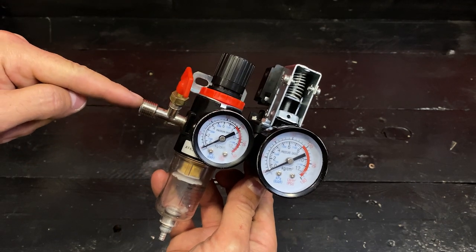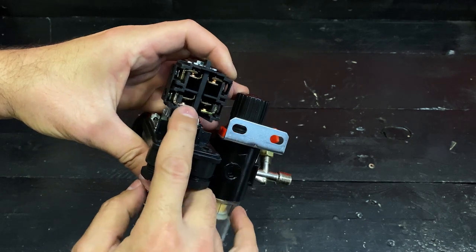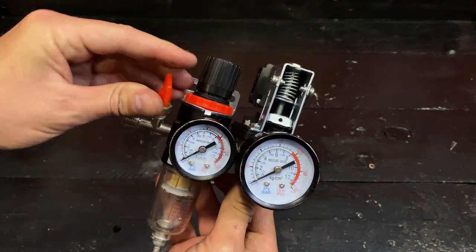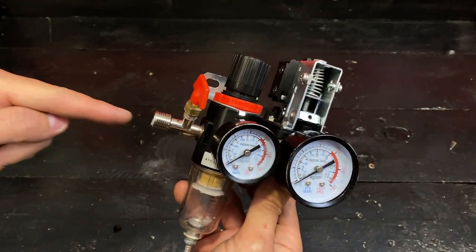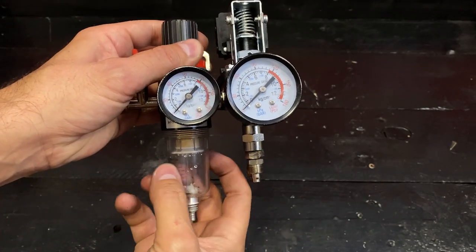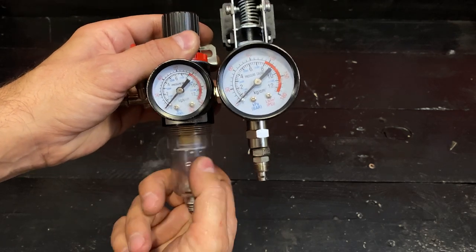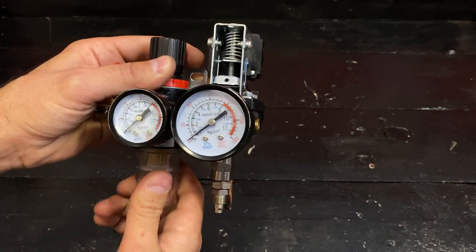When the output pressure of the biodigester drops, the spring goes up again. The contact opens again, and then the compressor stops. In this way, what we get is that the engine starts and stops every time we have gas pressure in the biodigester. With this tank, we collect the moisture that comes out of the biodigester and the hydrogen sulfide, so that all the gas that we inject into the butane cylinder is a clean and odorless gas.